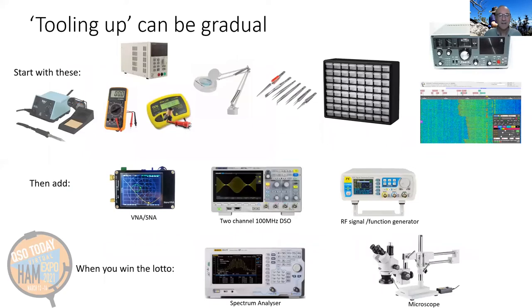Let's talk about the tools that I think are necessary. You really don't need anything particularly sophisticated to begin scratch building. One essential tool is a digital LC meter — it's essential that you're able to measure the inductance of your toroids and add or subtract turns, or compress or expand turns, to get your inductors spot on. A variable voltage, variable current power supply is also essential because you often want to start modules down on five or six volts and then wind up to 12 to 15 volts once you know they are working — particularly with gain stages and amplifiers. You also need current limiting: if you're building power stages, being able to current limit at 100 or 400 milliamps until you've got the bias set correctly will pick up shorts without doing damage.